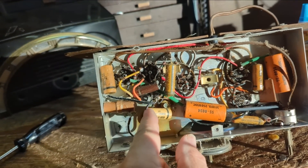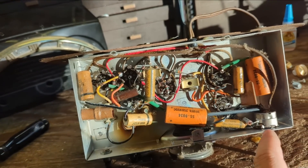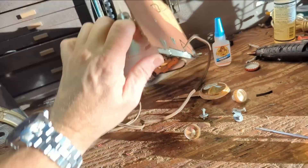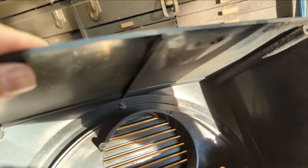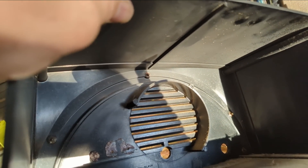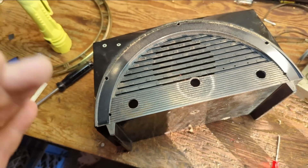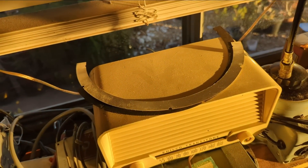This cap is the most important cap in the whole thing — this is one end of the AC line, so it's a floating chassis, meaning there's no true connection between the AC plug and the chassis. I need to focus on the cabinet first. I looked inside and there are tiny little clips holding the trim piece in, and I can just see breaking those off or having them fly away. I'm going to use a tiny little screwdriver to pry them off gently. I had a heck of a time getting that off, but I did — and what's behind it is foil, which is very delicate.